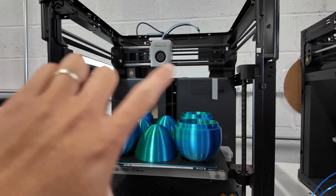The one other issue during Q4 last year was that the extruder gears — the yellow gears inside the extruder — kept getting worn out. The reason was that we were printing at ludicrous speed, which bumps the print speed from 100% up to 166%. Running all printers at 166 during Q4 really took a toll on those gears. They were the stock versions, not the hardened steel versions, and they degraded very rapidly.